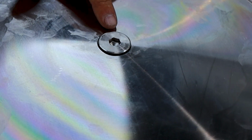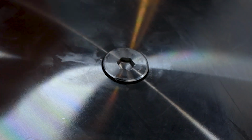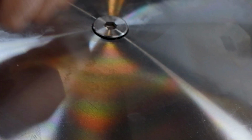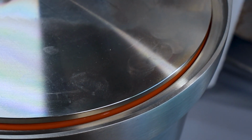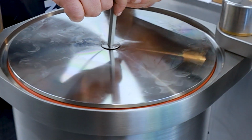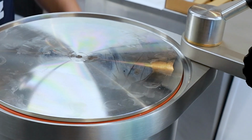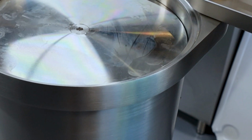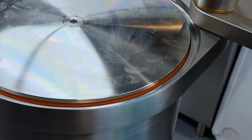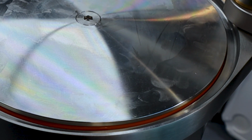So now if you did production like this, it would actually press up against the lid here. It would damage the threads on this bolt as well as the lid, and potentially maybe damage the sides of the inner housing inside. So always bring the piston down and bring it back up to ensure that this is flush. So now I'm going to proceed to tighten it. Now I feel it snug. And again, you do one more time to ensure that if I go right to the top, it's not going to protrude and hit the top of the lid here. So now the piston is secure and ready for my next process.